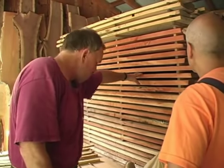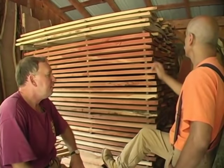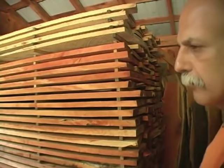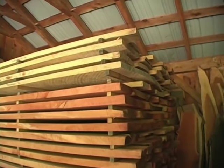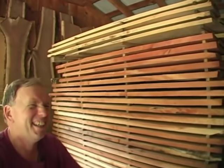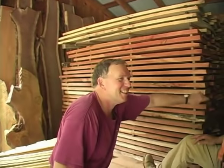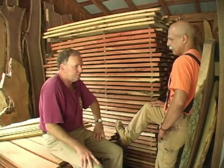I'm running my thumbnail across the end grain here. I coat the ends — yes, it's a waxy coating product that seals the ends. I seal the logs first, and then when I saw the lumber, I'm not out here painting the end of each board, because when it's sawed, it already has the sealer on it. It does a good job at restricting severe checks.